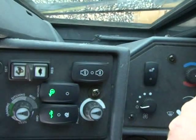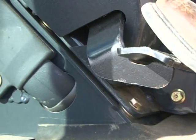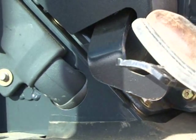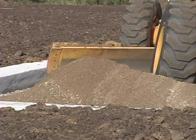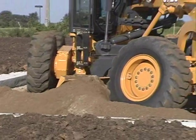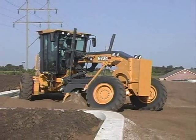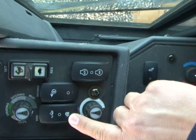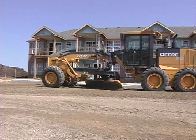John Deere has selectable hydrostatic front wheel drive inching capability. In the off position, the front wheel drive shuts off when the inching pedal is depressed. In the on position, the front wheel drive remains on and slows or increases with the tandems depending on how far the pedal is depressed or released — this allows the operator to do fine grading with front wheel drive on without worrying about sudden tire slippage at low RPMs. This inching capability operates in forward and reverse gears 1 through 3. 6-wheel drive units also have a precision mode: with the switch in the back position, only the front tires are powered, which is helpful in extremely fine grading conditions.